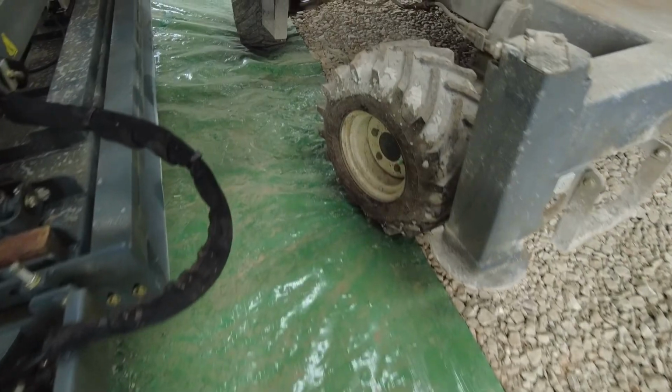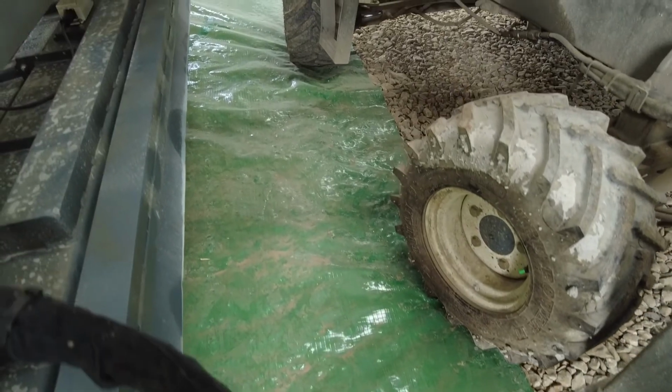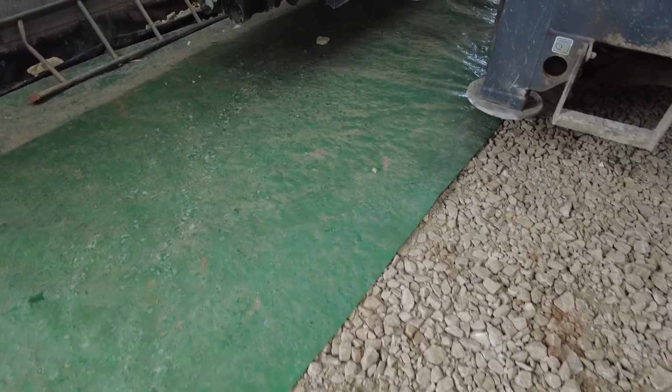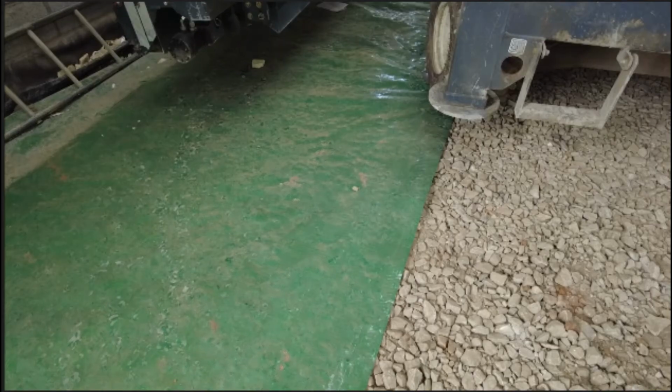As we scoot round just over here, what have we found? The laser screed has just parked on the edge there, and to top off the catalogue of disasters, the subgrade here, the stone formation is just shocking. Not been rolled, not been levelled, no sand blinding, and not even a geotextile or any void, anything to protect it, has been factored in here. So not a good day.